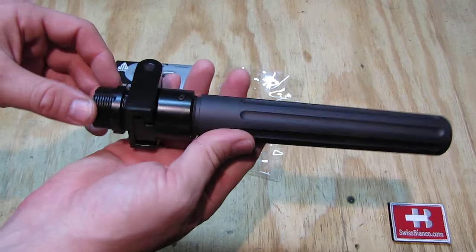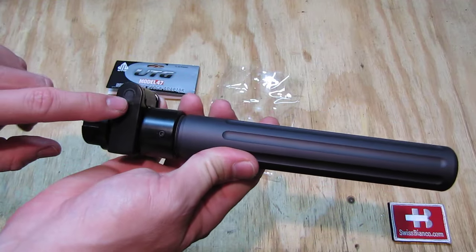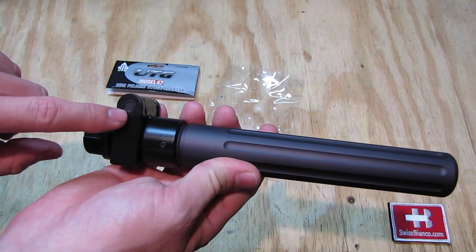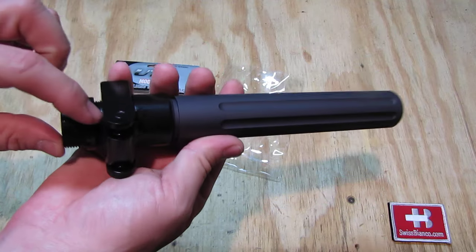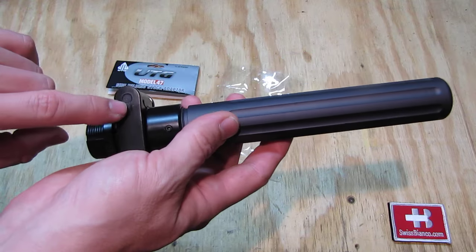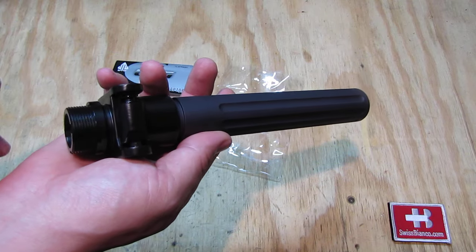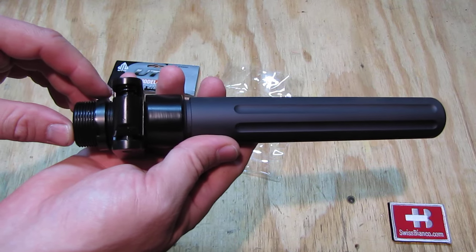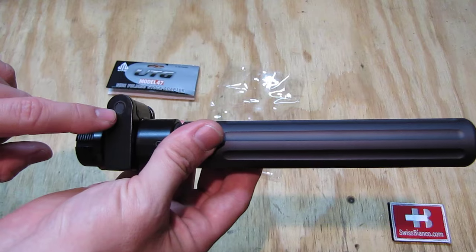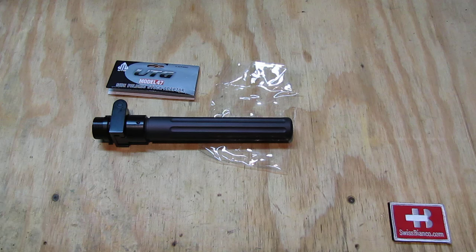What is not easy to take apart is the hinge part itself. It appears to be a threaded metal screw, minimum on one side, but they have completely removed the head so you can't take it apart to check the spring. If you need to repair or modify it, you would need to make a new screw that goes all the way through — this time with a head, pin, or something you can remove.